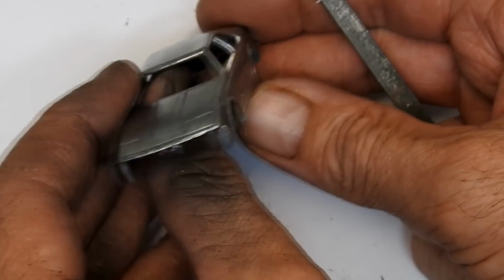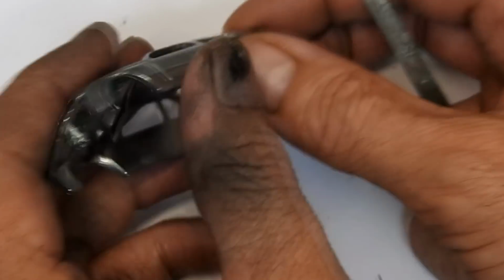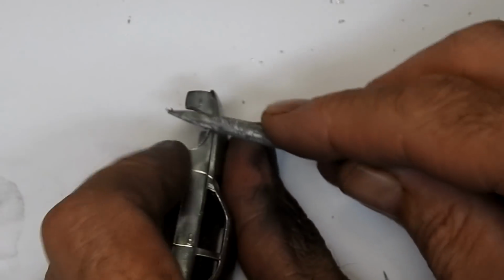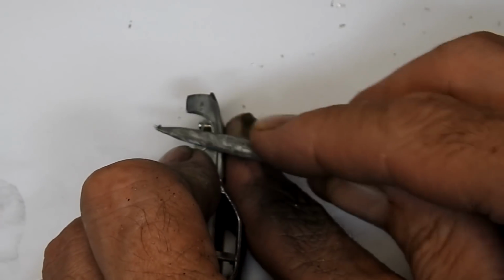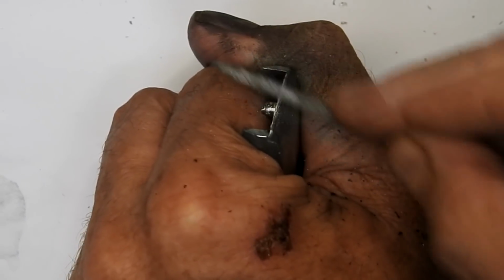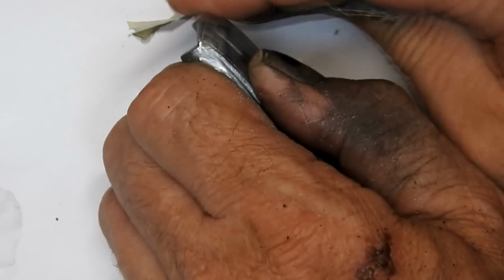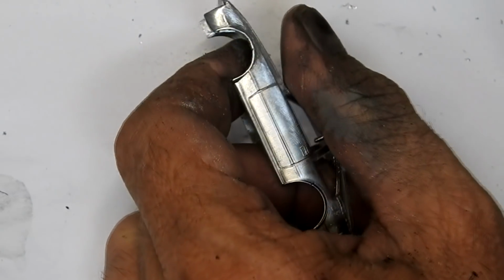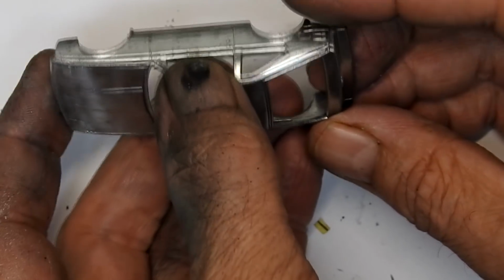The front of the bonnet there is a bit rough, and it's got a few chinks taken out of this front left guard here. So I'll start giving them a bit of a clean up with my needle file. I use a half round needle file for most of my cleanup work like this. And after filing, it gets a sand. Also along these side panels, I had to work them down a little bit as there were casting lines on them. It's starting to look a bit better.